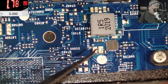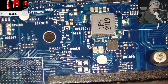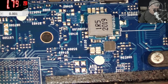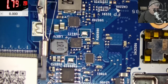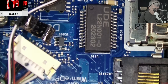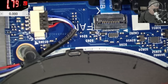Here we have some damage but it's not important — this is the main power rail. The battery is charging at 1.7 amps, so that's not a problem. The liquid next to the battery connector is not a problem either because we have 19 volts on screen, so the capacitors are good. Checking further — that's fine, that's okay.